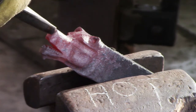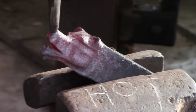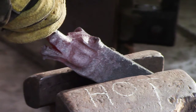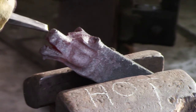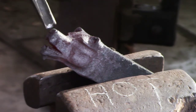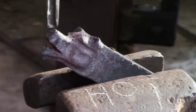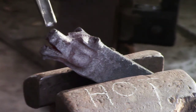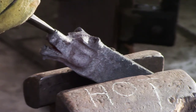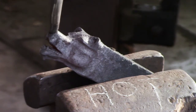First thing I'm going to do is just isolate the material that will be the nose — I want to say it's going to be about 80% of what is the front of the snout. It's not all of it but it's certainly most of it. Come along and change the angle of your cutting tool just so you can create a nice circle there which is going to be the nose. Once you've got the nose established, we're going to come back in with a side set and remove everything to the side of the nose, pushing all that material back, making the nose stand out and making it proud.